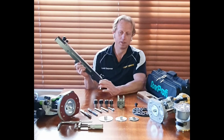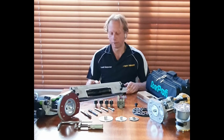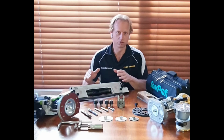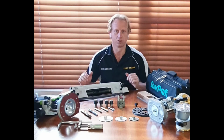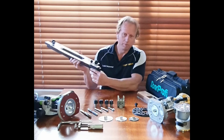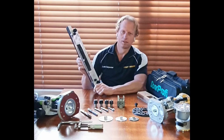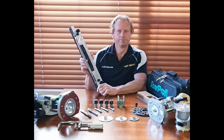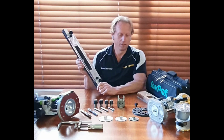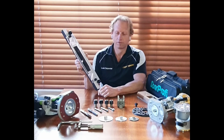It's not limited to just installing one hinge. You're not going to pay hundreds of dollars for this just so you can install a 100mm butt hinge. It's a perspex base with an aluminium side rail and it's designed to route out for hinges, concealed hinges, face plates for locks, lock bodies, flush pulls.